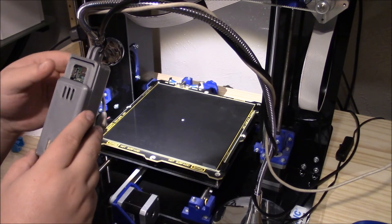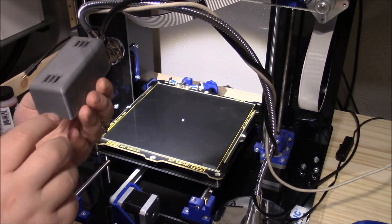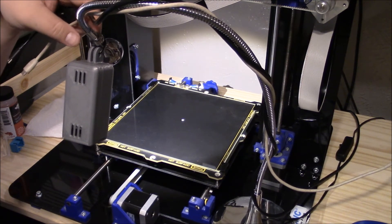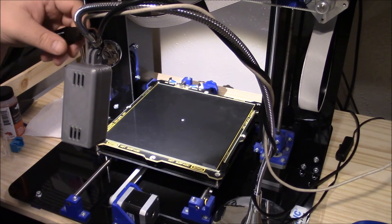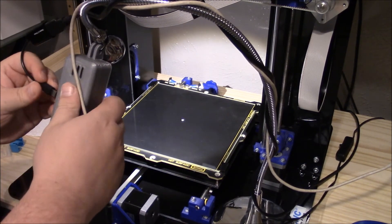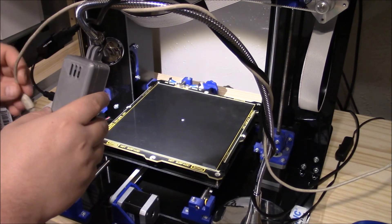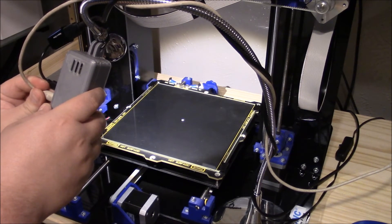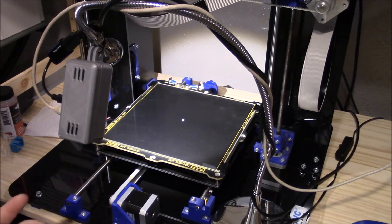But this is a screwless design. What's cool about it is it has this retaining piece, and then you basically just slide this on and it has a little snap. Just for simplicity, I actually have this thing zip-tied on — because why reinvent the wheel on that one? Then all you have to do is plug in — one of them is USB data and one of them is micro-USB power. You should see a little green light in there. The green light just shows that it's reading and writing.